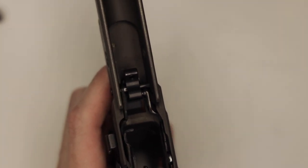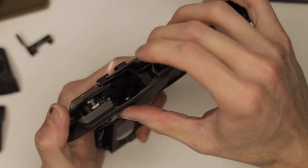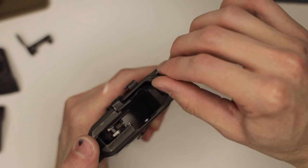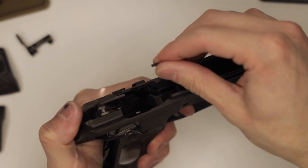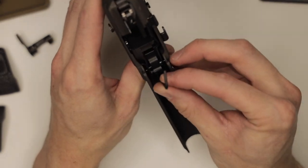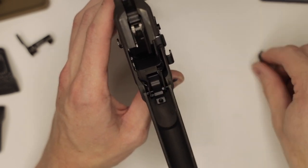The easiest way to adjust your over-travel is going to be this top screw — righty tighty. We're going to turn it in, cock the gun, pull the trigger. Gun still goes off, so I still have more room to go. Cock the hammer, pull the trigger — still drops. We'll go a little bit more. It still drops just barely, so I'll go a little bit more. The gun no longer fires while pulling the trigger. Now we will back this Allen wrench off slowly, just a little bit at a time, until the hammer wants to fall. After I get to that point, I'll take my Allen wrench, point it straight up, and usually go about a quarter turn — maybe sometimes a little bit less. And your over-travel is set.